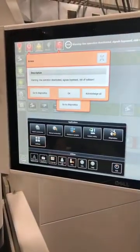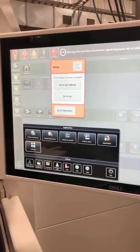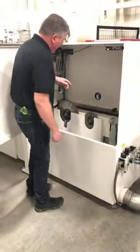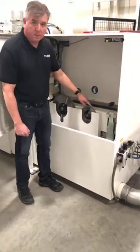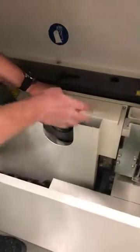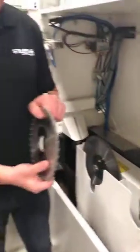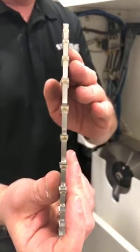Right now I'm in a mode where I'm not in line mode — it's warning me about that, and that's fine. I told it to take the blade down to the tool change position. Within the tool change position we have an interlock — a one-minute timeout before it will actually let me open the door. I can change my scoring blade and my main blade. The main blade is on top, the scoring blade on bottom. To change the blade, it's a simple Allen key — I loosen it and the blade comes off. The blade is conical, tapered like a triangle. As you go higher it gets wider, and you can go left or right to position the scoring blade.